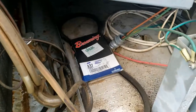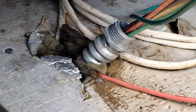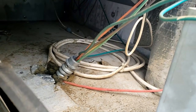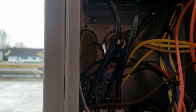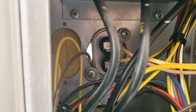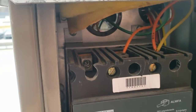I'm looking at this fancy inspected electrical job — I'm not an electrician by trade, but I'm surprised you're allowed to do that. It just doesn't look like the right way to do it. If you follow the wires up, there's two of the wires going to the breaker. We got a yellow one, an orange one — there should be a brown one going somewhere. I think that brown one comes in here. I bet you they lost a leg on this breaker. Look at that — they ran that wire right through that hole. This is 270-some volts per leg and they came straight down to the bottom. Yeah, that's the problem — they have one leg out on their breaker.